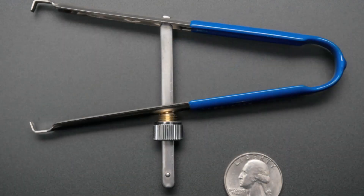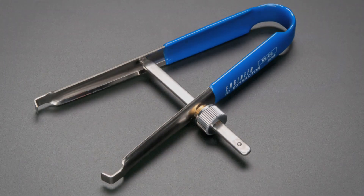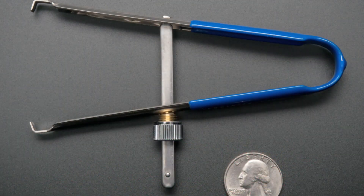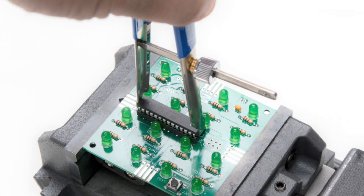What is this, Lady Ada? This is an IC extractor that doesn't suck. So we've had — it's the name brand. So this is an IC extractor. Most IC extractors kind of suck because they don't have this really nice thumb screw in the middle that keeps it at a certain distance. You're supposed to hold it with your hands and they're always really uncomfortable, and they always end up slipping and pulling the chip out wrong or not straight — they bend the pins. The real nice thing about this IC extractor is it's got really good tips.